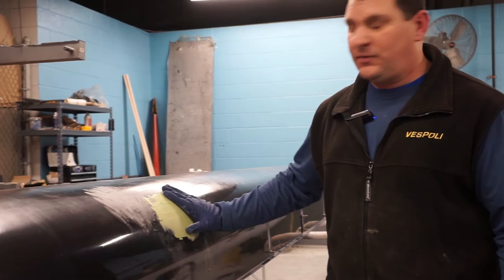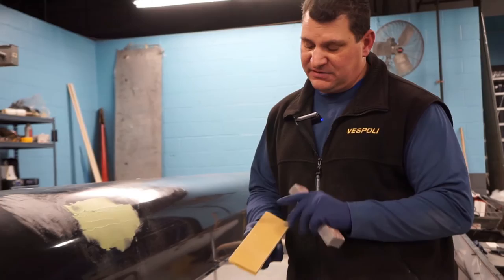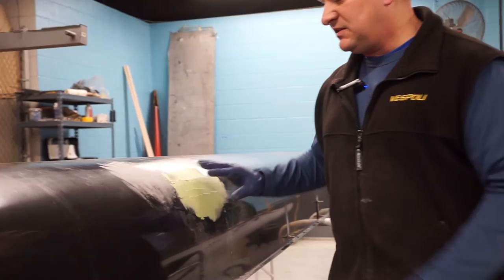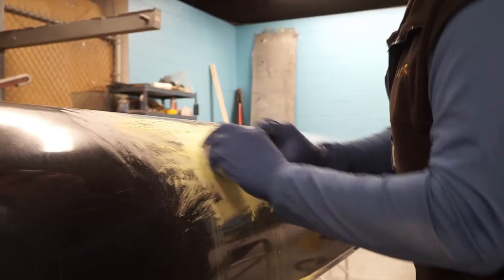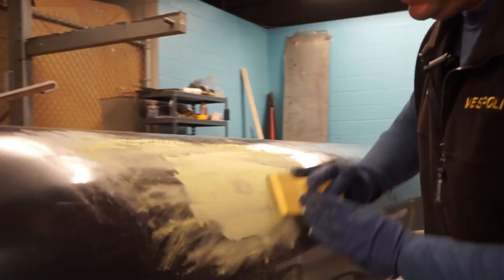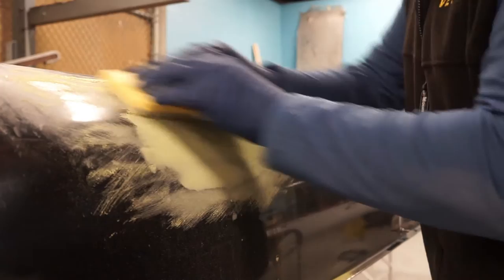Our body filler has hardened — it's been about 20 minutes. Now we're going to sand this down and shape the hull to get ready for our final steps of priming and painting. We're going to start off with our 80 grit and then transition to 150 to 200 grit to get nice small light scratches that will be filled in with our primer later on. At this stage, we want to make sure we're following the contour of the hull, keeping our block in line with the long run of the hull. Every time we switch to a finer grit, it leaves smaller and smaller scratches until we get to where the primer will fill them in.